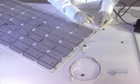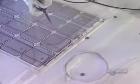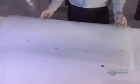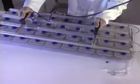The modules are placed into position. Then this metallic strip is inserted, which is a conductor that will link the four groups of nine modules. Solder connections are made to link the modules to the metallic strip. Then they put on this transparent sheet of layered glass, which serves as a rigid, transparent form to support the modules.